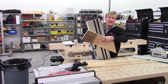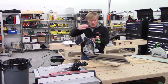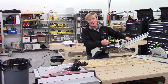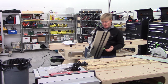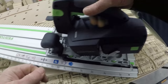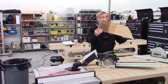I've checked it with a machinist square and I'm getting absolutely perfect cuts. For framing you've got to do a lot of compound cuts when cutting rafters, hips, valleys, and those kinds of things. So you throw the saw over for the bevel cut, and then with the stops you've got your miter cut, so you can make repeated rafter cuts. If I want to make a 90-degree cut, I set my gauge to zero. The bottom of the material will butt right against the two stops. I set my depth — this material is three-quarter inch, and I'm riding on the FS index, so I'll go to the FS index and set it right to three-quarter. It locks right in with no knobs to turn, then come right up to the edge of my material, place it up against there, and get a perfect 90-degree cut.